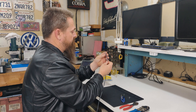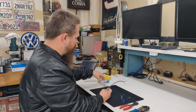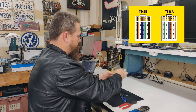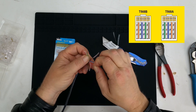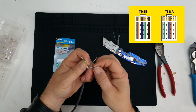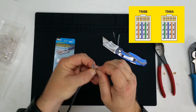Once you get these separated, now we need to put them in order. When you buy your cable ends, they're going to come with a little card that actually has the color code in it. I'll post one of those up here. The order is: green white, green, orange white, blue, blue white, orange, and brown white, brown.